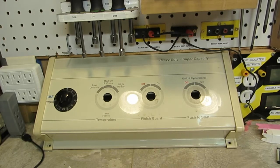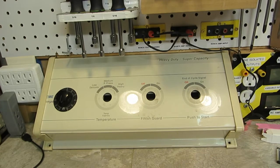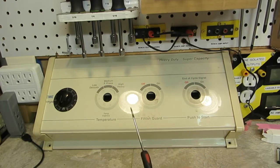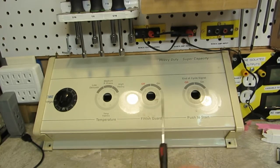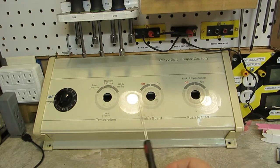That's two obvious things it needs. It needs an RF and AF signal generator — RF with modulation and an AF out — basically just like the B&K E200D over here, the same thing. It doesn't have to be that elaborate. We're just working on AM/FM radios and things like that; it could be used for other stuff as well, but keep it simple enough. And I'll go over that more in a minute, but that would be another component. Also, AF and RF signal tracing — it would incorporate that as well.